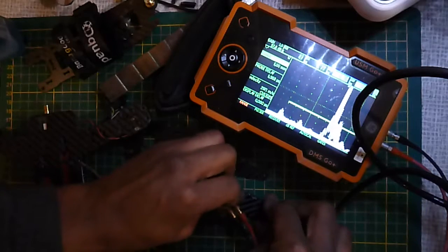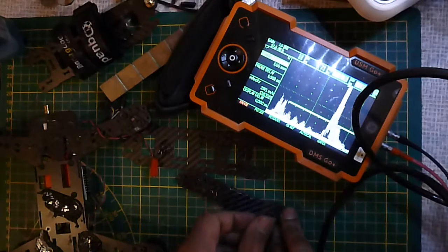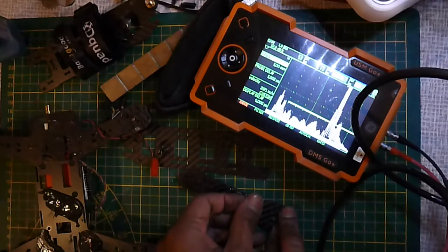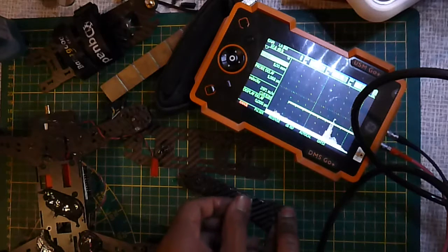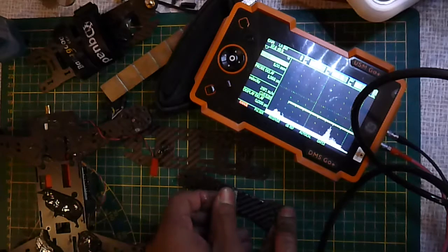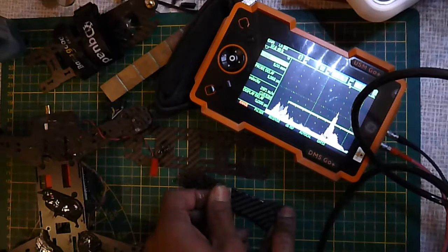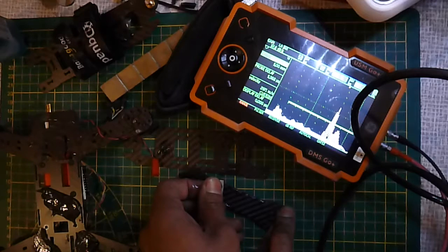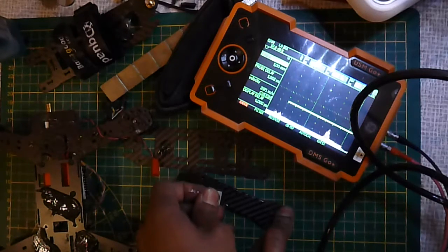It's also one of the smallest probes we use in our work, and it's not known for its stability. Normally, when we slide over metals to find corrosion on the other side of the metal, we use bigger probes because they're more stable, thus more reliable. But for thinner wall thicknesses, we use smaller probes because the sound bundle is also smaller, so you have a higher resolution.